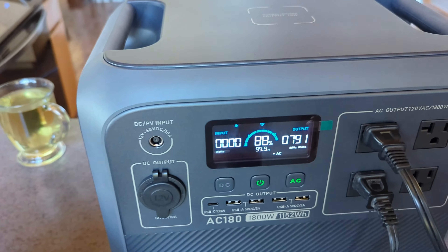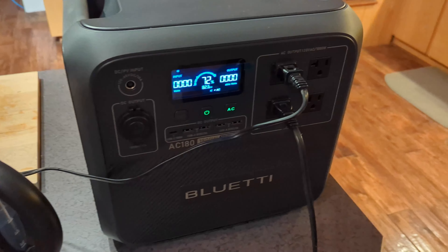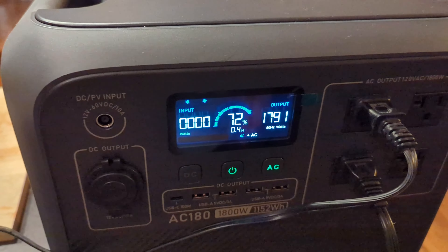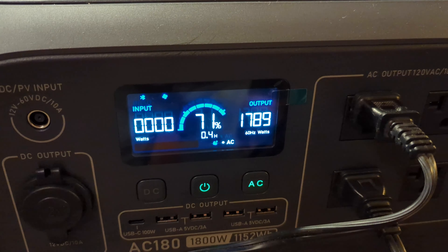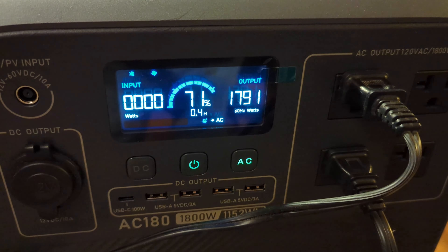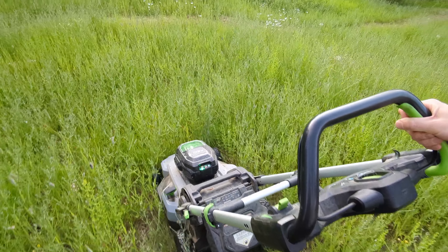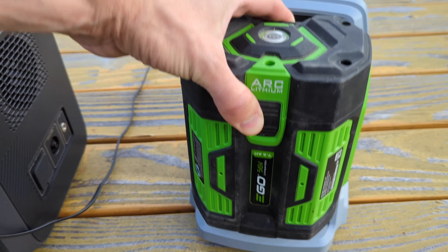In this scenario the power lifting feature would be great to try because it can take you up to 2700 watts for pure resistive loads like heaters. I put this to the test — I enabled power lifting mode, started the water kettle, then the toaster, and was very surprised to see the power output was capped at just under 1800 watts. With power lifting, it modifies the voltage so it can increase the amperage without exceeding the total power limit. A lot of my tools run on the EGO battery system and being able to charge these batteries with solar is going to be a great benefit.